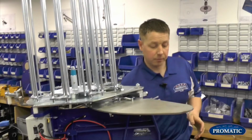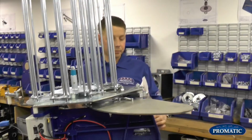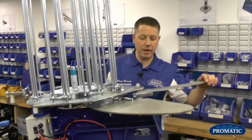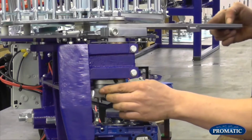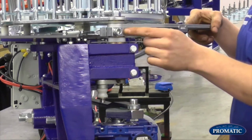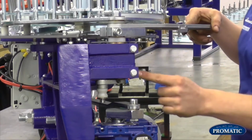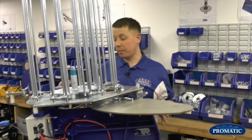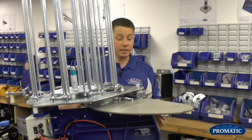And as you're doing that, how would you know what is the right position? The right position is as you bring him round there now. We know the main shaft is just poking just slightly through, and then your reference is your clamp lock is in line with the actual split. It's when you put your spring back on to know that you've actually got it right.